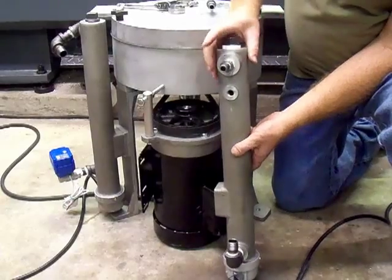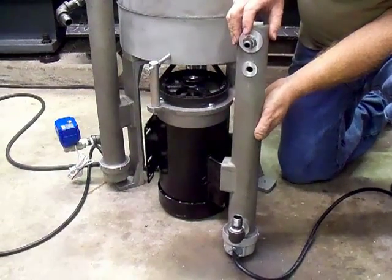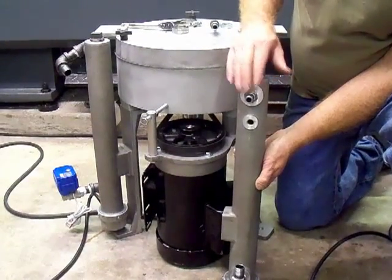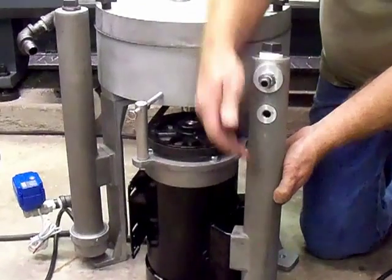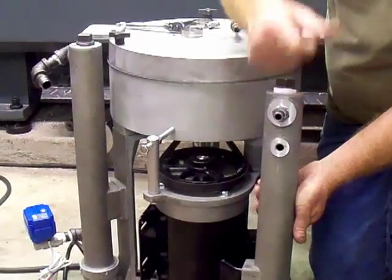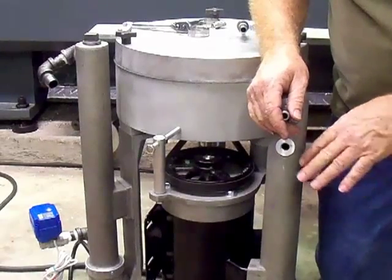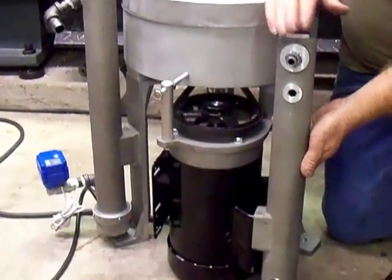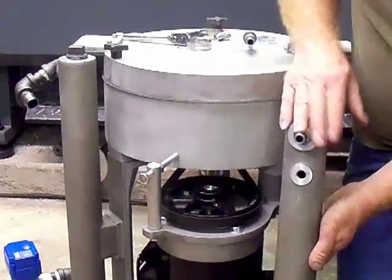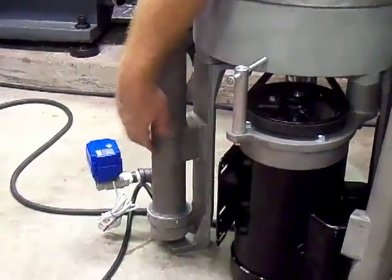I'll want you to see how this one looks. This is the output to the centrifuge — the centrifuge input — and we use a hose between here. You never put a valve between the heater output and centrifuge input. If you have water or something and it boils or makes steam, you never want this sealed up, so you don't get pressure and back force trash back into your tank or blow a gasket. You always want to have this one open to the centrifuge at all times. You never put a valve here.